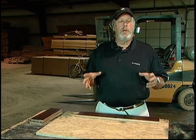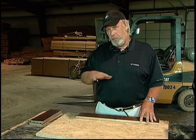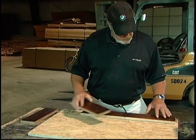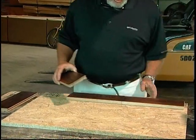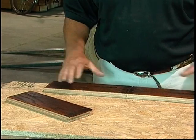If your flooring cups just a little bit in the summertime where the humidity is high, don't panic. Your dry time is the wintertime — it typically lays back down. But as you start your boards, make sure that you've chalked your line and go back and check your line every so often that you haven't knocked it back off the skew.